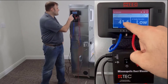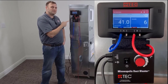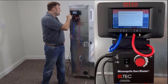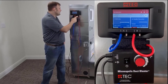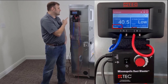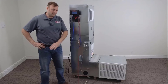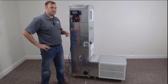So what we need to do now is set NSOP. This one's going to count down, so we're going to watch the gauge on this measurement — it will get to 10 seconds. We can select enter and it'll give us some instructions to move forward. We click OK. We can now turn the system off. The system has captured our normal system operating pressure, shown at the bottom of the gauge. Now we're going to hook the duct blaster up and make all the airflow go through the duct blaster fan, pull that second static measurement, and use the duct blaster fan to get that pressure up there.